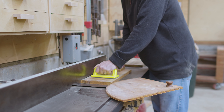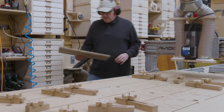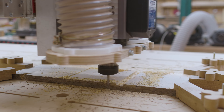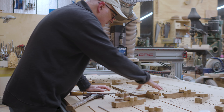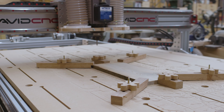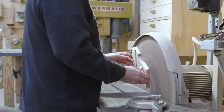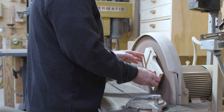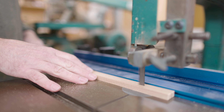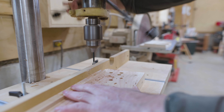The first thing I did was make a new jig to hold the triangles on the table saw — this is the only thing I'm doing on the CNC machine. I have an equilateral triangle jig I used for the globe, but because this sphere would have a different angle on the sides with the table saw set at a different angle, I decided to just make a new jig. I cut a top and bottom plate: the bottom rides on the table saw and the upper plate holds the triangle in place. Then I made a piece to fit within the table saw track.